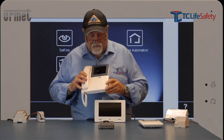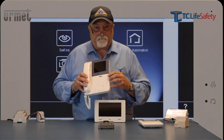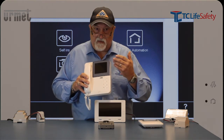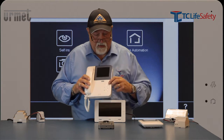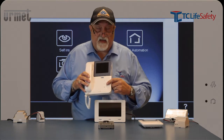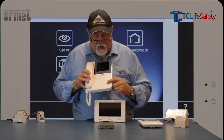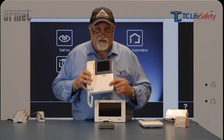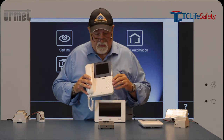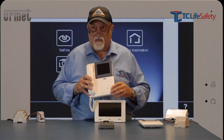There are three other buttons on the front. The top button is for the S1 output, which controls the garage door opener, outside lights, or gate — so you can open gates with the push of a button. The second button has a key icon next to it; that's to buzz somebody into a door — that's the 12-volt door buzzer option. The bottom button has an eyeball icon: pressing it turns on the camera at the doorbell but does not turn on the speaker, so you can do a surveillance-type check. If you hear noises outside, you push the button and take a look at what's going on.